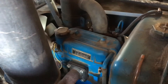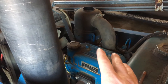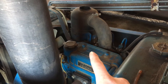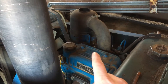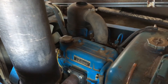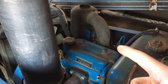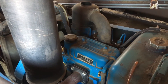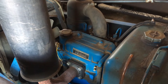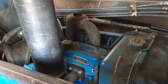Compared to a modern machine, this is a two-cylinder diesel engine rated at 25 horsepower. This machine is incredible on fuel economy. However, the two-cylinder vibrates quite a bit more than a three-cylinder would, particularly at certain RPM levels — that's another complaint — but otherwise this engine runs great and is quite reliable. This tractor has a very efficient drivetrain: rated at 25 horsepower, it specs out at 23 and a quarter horsepower at the PTO. You won't find a 25-horsepower engine in a tractor today putting out that kind of PTO horsepower, particularly with a hydrostatic transmission, which sucks away some engine horsepower. Gear drive transmissions come a little closer.